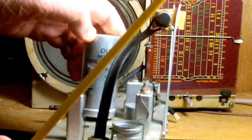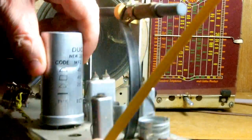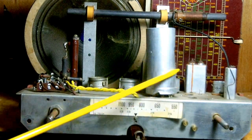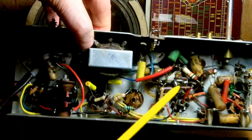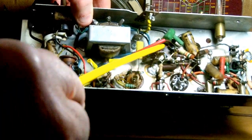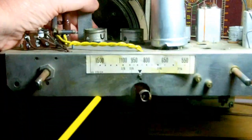The three values are 40 microfarads, 40 microfarads, 20 microfarads, at 350 volts — Dukon. To replace that is a real pain. That's why I don't like electrolytics being placed in a can. If you want to disconnect it and just put in three ordinary electrolytics, you've got to work out the circuit. I haven't even got a circuit for this thing. It's just too much trouble. It's much easier to replace an electrolytic that's mounted under the chassis and not on top.